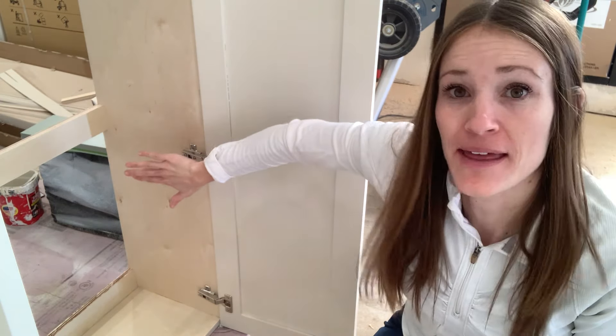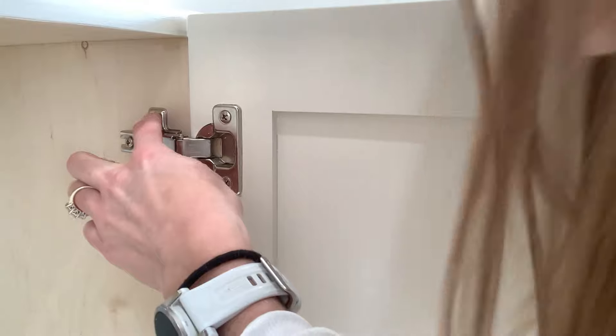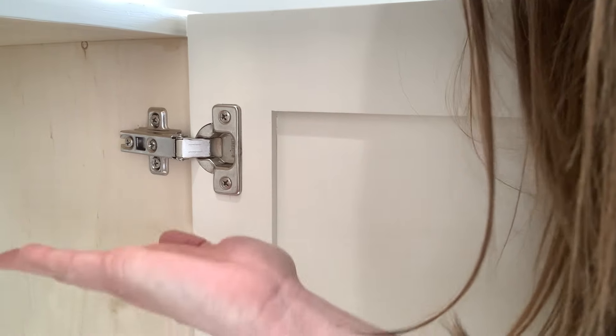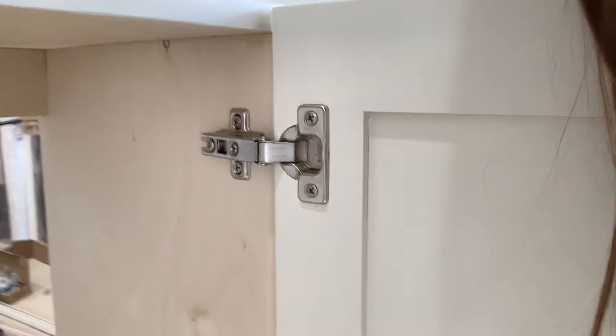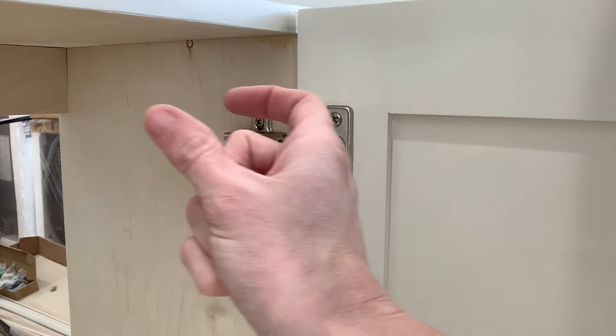Once you get your cabinet doors on, you'll likely want to make some adjustments — and that's okay because you have a couple of options on the hinge. The two spots where you attach it to the carcass are slightly oval-shaped, so if you loosen those screws on all your hinges you'll have some slide room to move the door up and down. The back screw, if you loosen it, lets you slide your door forward or backward on the cabinet, giving you in-and-out room. Loosening and tightening the front adjustment screw moves your door laterally — left to right — if you want to change the gap or reveal on one side or in the center of your cabinet.